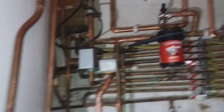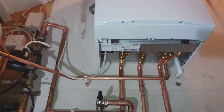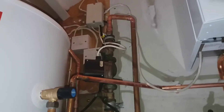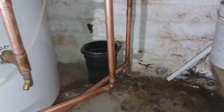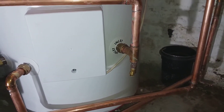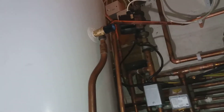There are two zone valves — hot water and heating — and there's the piping done for the Vaillant 637 system boiler. There's an external pump connected to the flow side; it already has an internal return pump. There's a drain cock for the heating and a drain cock for the whole cylinder cold water.